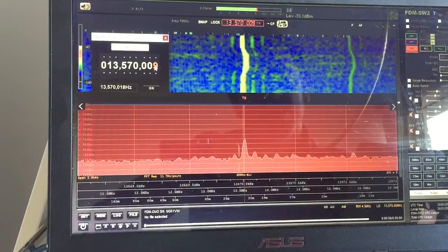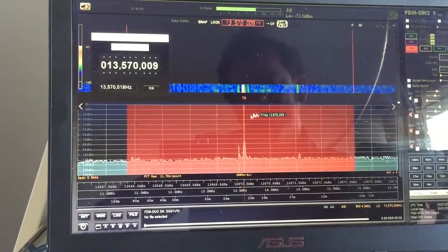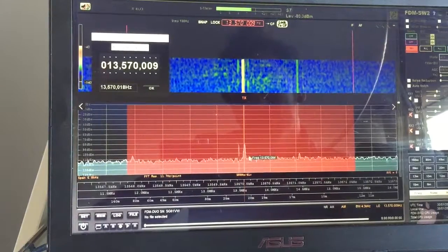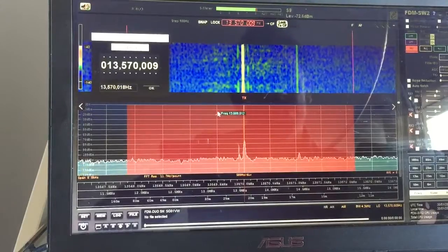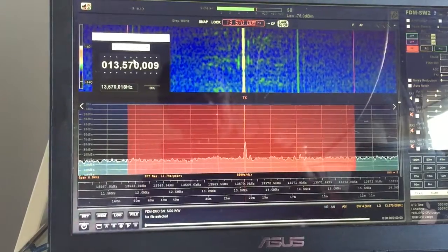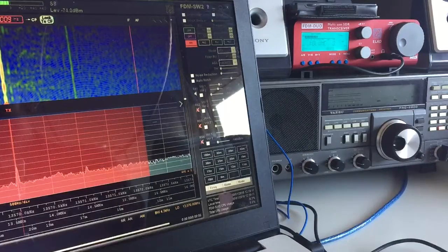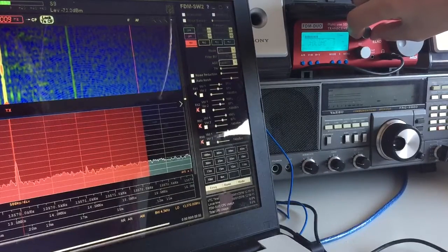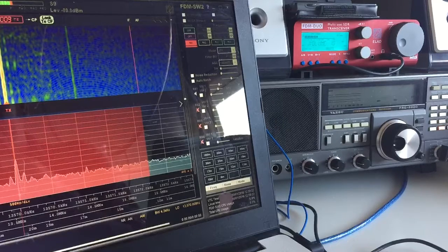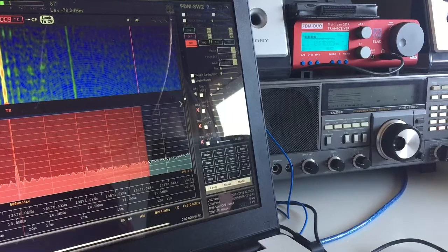And that's the beauty of having an SDR. Using the receiver without a spectrum display, you're tuning largely by ear. For me, having the option to tune down to a resolution of one hertz and look at the signal means your tuning is always going to be on point. So here we are, controlling the radio with the computer while still using the audio output from the unit itself — you get the best of both worlds. There are at least half a dozen ways to tune this radio, and that's the beauty of it. Thanks for watching.